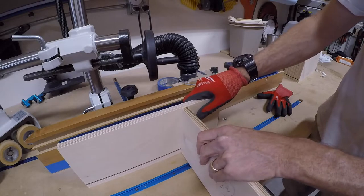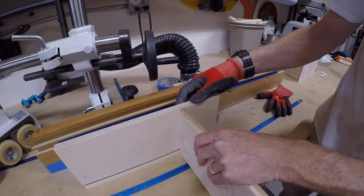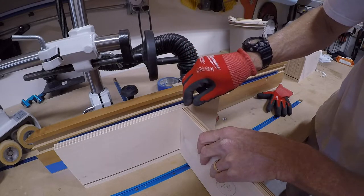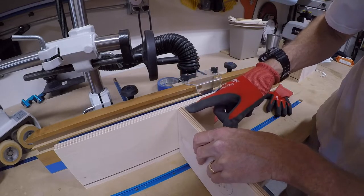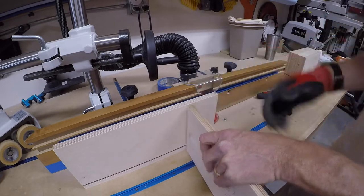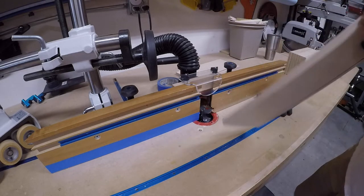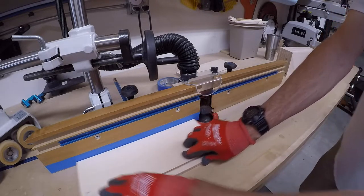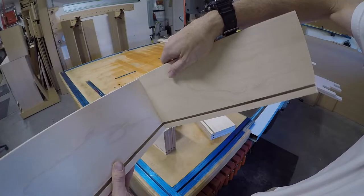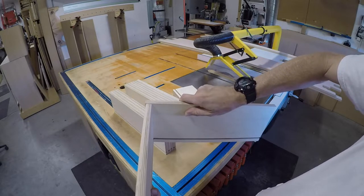If I keep all these pieces the same height, when these pieces intersect, there's going to be a void left over. So what we do is we'll subtract the height of the fronts and backs, and we'll drop it down by the amount this drops down. That is, you know, an eighth inch or so. It doesn't have to be the same, but it just has to be something. So an 1/8 inch I'll take away. See the drop down of that piece there. By taking off 1/8 of an inch, you can see what that left me with.